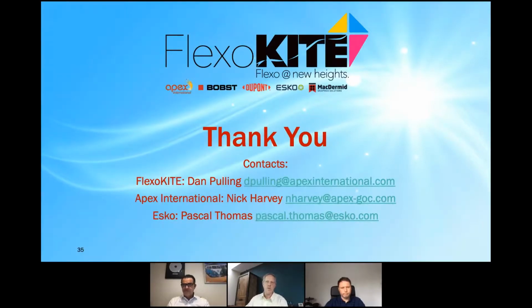And then another question here, probably for you, Nick. What would you suggest for printing white on a high speed press to reduce these? I think it's dust generated in the print. Misting. So probably misting, yeah. Yeah, that's an interesting question. It's obviously some presses are getting faster and faster. We did actually do again an innovation test and trial with a large OEM. I won't mention it, but it's one of the largest, based on evaluating different forms of the GTT engraving. And we managed to run an engraving up to 600 meters per minute, not with any misting. It also didn't have any density drop down. It was very controlled, very consistent.